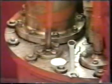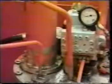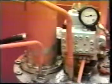The best way to test the cargo pump is to blind off and pressure test the cofferdam with 3.5 to 4 bar air pressure. If there is a leak, the air pressure in the cofferdam will decrease rapidly, and by testing the pump with liquid soap or similar, the leakage can be detected.